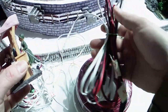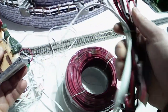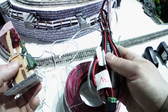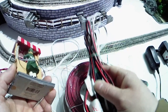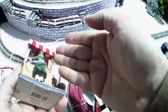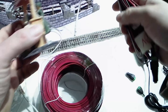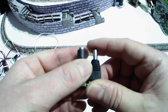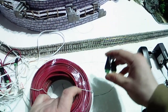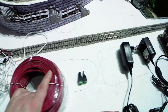each cable. Once I've deployed all the cable all along the layout and down under the plywood, I will be in trouble if I connect the 3-volt cord to the 4.5 volt adapter. The LED will simply blow. And then, I've talked about this plug, and don't worry, I will certainly place some links for you down in the comments if ever you need them.